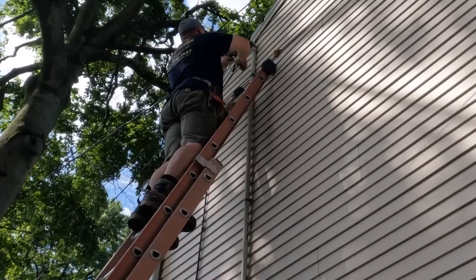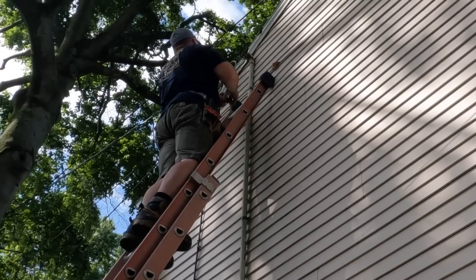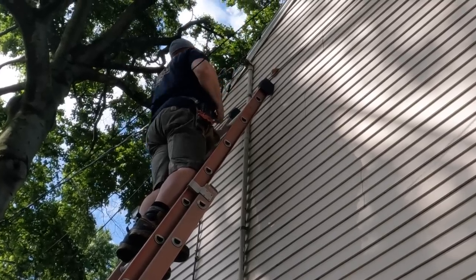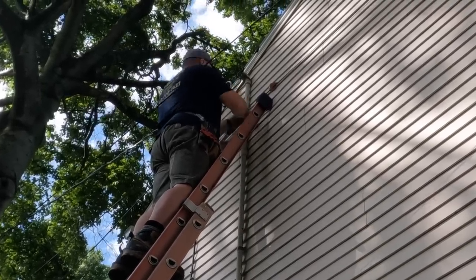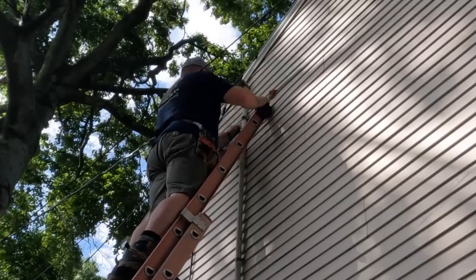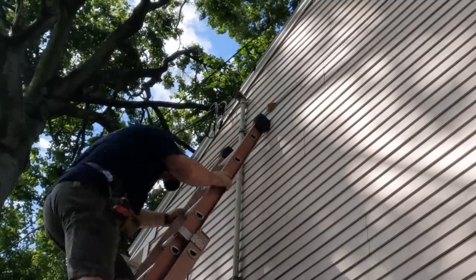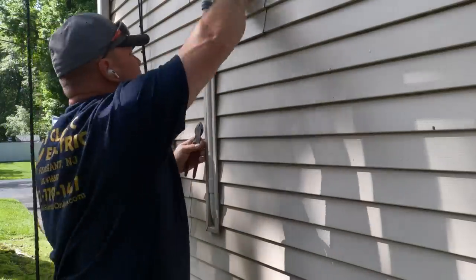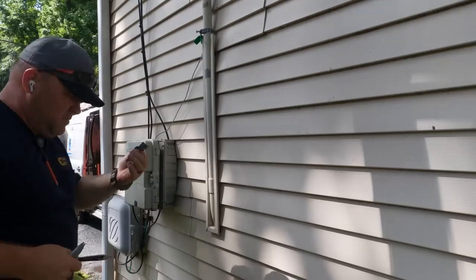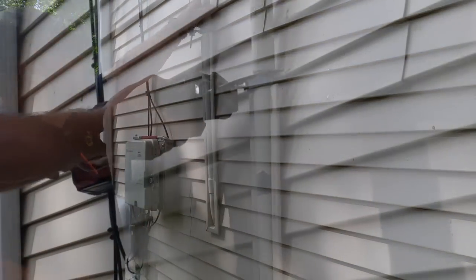Cutting out was pretty simple here. I've got plenty of room right in front of me, no branches, nothing in my way, so I'm just cutting. Then what I do is safe off the supply side with some vinyl tape, just so it doesn't arc between it and the ground or the house — just for safety. I'm not tying in any temporary power whatsoever. The only time I need extra power at that job is to heat up the PVC, and I'll either do that the night before or first thing when I get there.